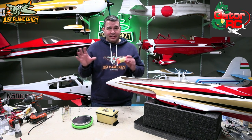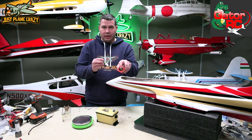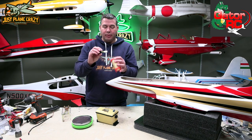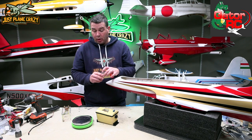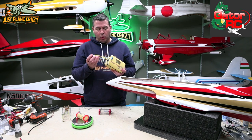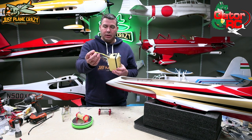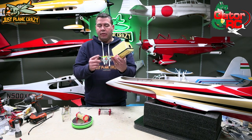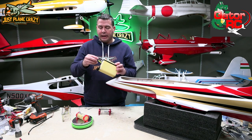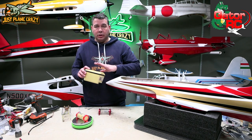I do what works for me and I take knowledge from everybody and try to make sense of it. Inside the tank, you can't unscrew these — there's a nice metal insert inside. We have an O-ring on an aluminum end. He does a nice job safety wiring. The UAT is a felt filter style. I'm still going to run a fuel filter — I'd prefer not to have any junk in the system. The 1-liter tank with the UAT gets you 1.3 total. He uses a hardened brass clunk and puts a little piece of fuel tubing in to prevent it from coming forward. Everything is safety wired. I noticed a lot of dust inside from manufacturing, so we're going to flush both with rubbing alcohol to make sure there's no dust and debris before hooking this up.